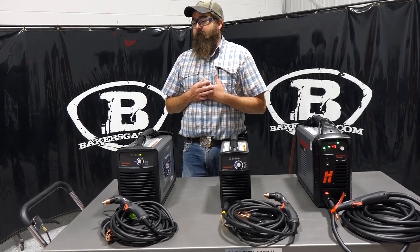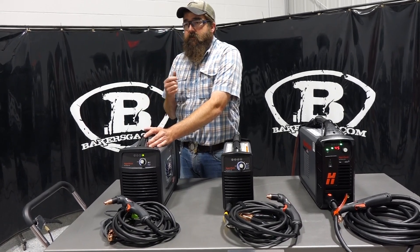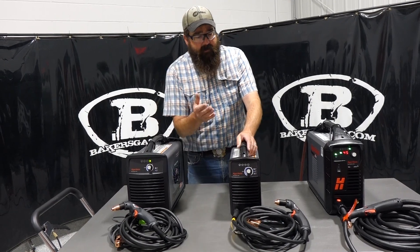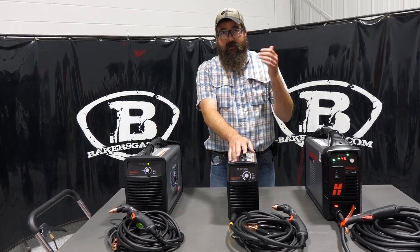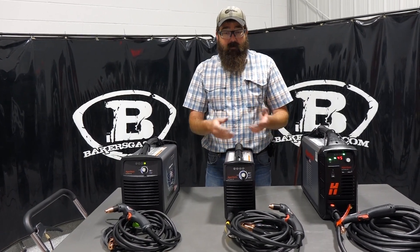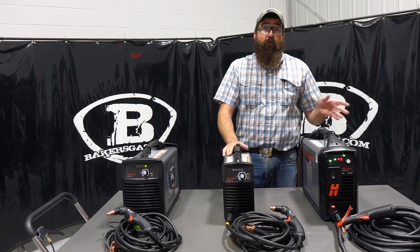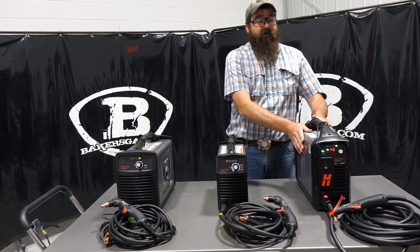In my opinion, the 30 Air would be awesome if you didn't have an air compressor or you just had to get to a spot where you weren't going to drag an air compressor. But if you're in a home hobby shop, on the farm, that sort of thing — you've got air, you've got 220 — the 30 XP is awesome. We can go 3/8's material, half inch material, and it'll cut it all day no problem. Small, portable, light, just nice. But if you're going to step up into the 1 inch area plate, or 5/8's, 7/8's plate, the 45 XP is for you.